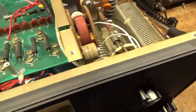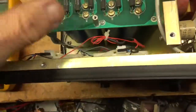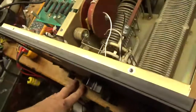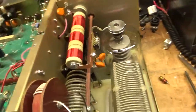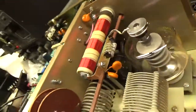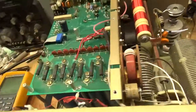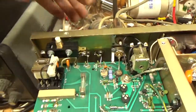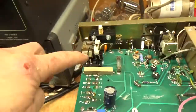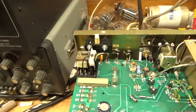Got rid of that board that wasn't working properly, re-soldered everything, zip tied. Put the parasitic board in, put the new plate choke in, so it's all nice. Tightened up some loose hardware and solder connections, re-soldered the TRRCA jack properly, and cleaned the relay for the soft start on the primary side.